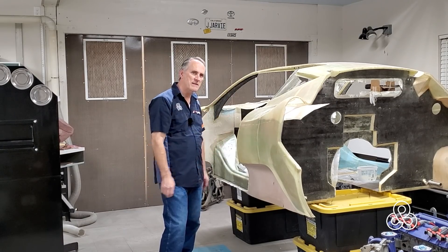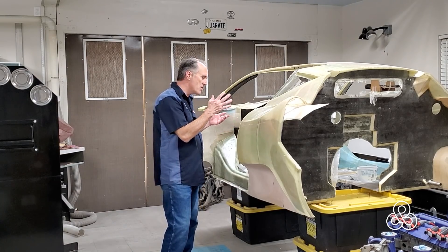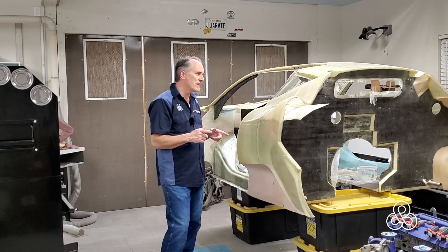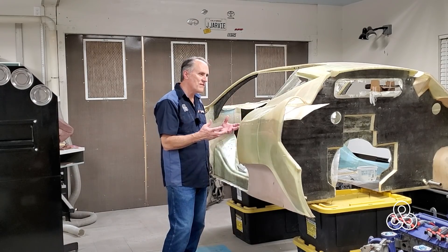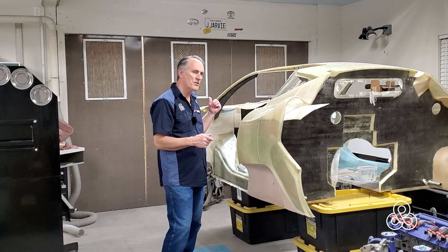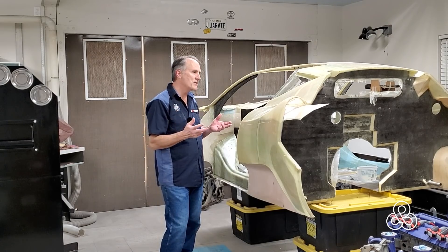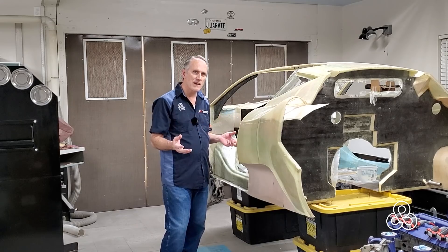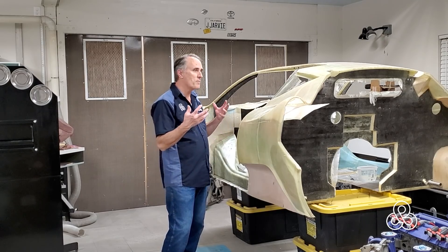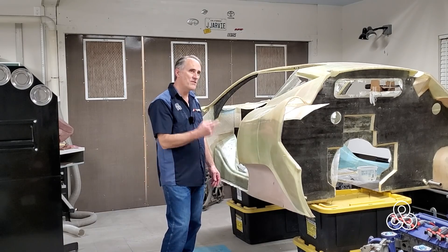We'll put the weather stripping and seals on it and then create the door around those pieces. If we were going to take this to production, we could literally step in here with a 3D scanner and then go produce the molds — molds that would need to be much more durable, with less flex and larger flanges for infusion or vacuum forming. Those molds would be rather expensive, on the order of four or five times what we paid to produce the current molds. Starting budget was $25,000 and we're pushing about $30,000 right now; production-oriented molds would have been closer to $15,000–$20,000.